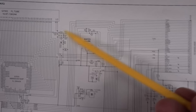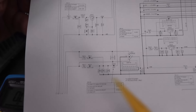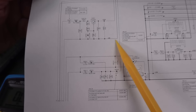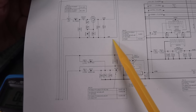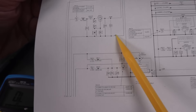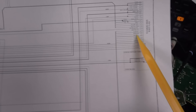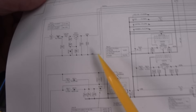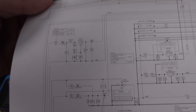Don't know — is it being generated over there? I thought it was generated here, but we don't have enough voltage there. Where's this going? I'm going to follow the money. Oh! If I actually engaged my brain, I would have known that that negative VP voltage — we should have checked that, we should have known it was negative, and we could have saved a bit of time there. Anyway, this is actually on the video switch board. So over here — there's our plus five, our plus 5 volt display. We've got that no problems whatsoever. But the negative VP is actually generated down here. There you go — there's a 30-something volt Zener. And it's supposed to be negative VP — it's actually marked as minus 35 volts. So we're clearly not getting that. That's why it ain't working.